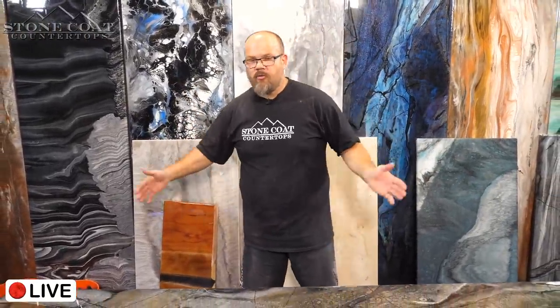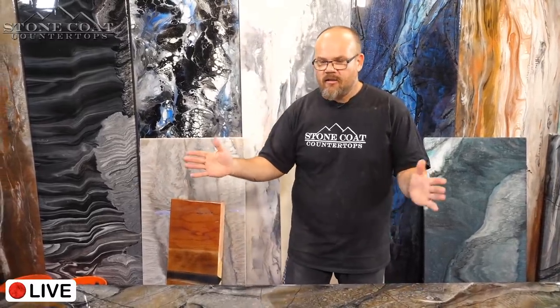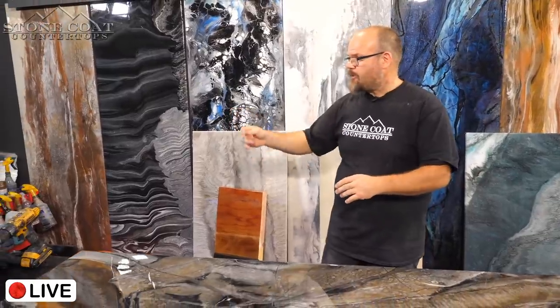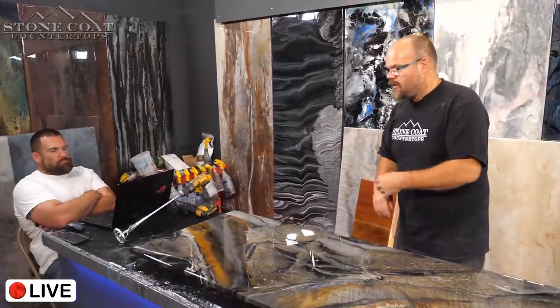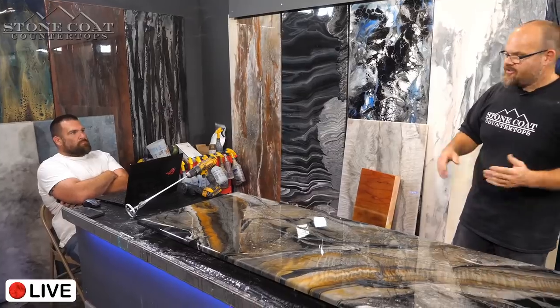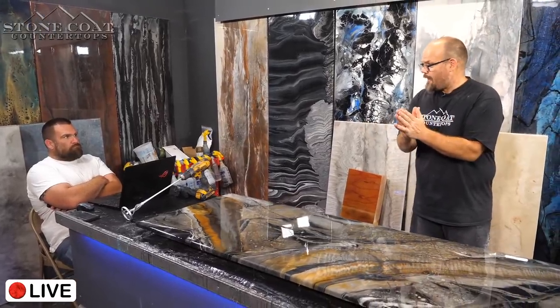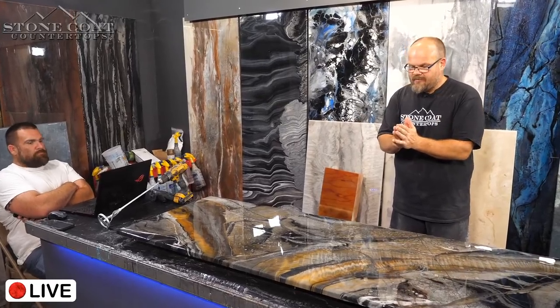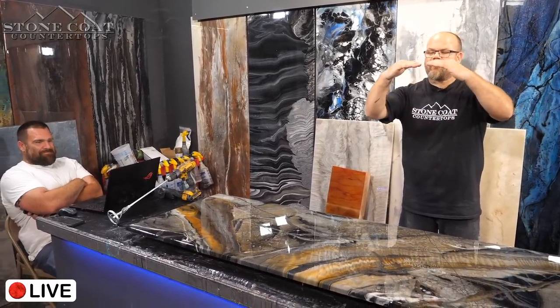apply the top coat. So when we bring it together on site, we use biscuits and quick coat, which dries fast, and then you can tint that quick coat. So let's say it's white, tint it white. If it's black, you tint it black, just like you would bring a seam together with granite. You pre-biscuit that because the biscuits are going to align it vertically again.